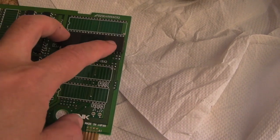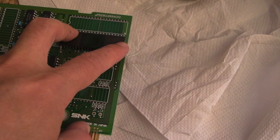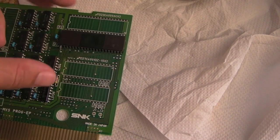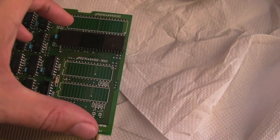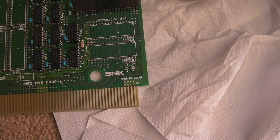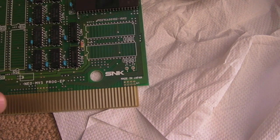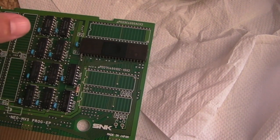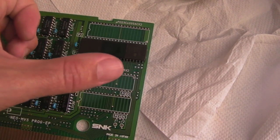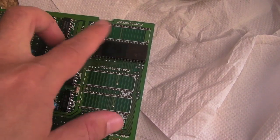It's a case of finding your two images for your game. In this case I think they're both 512 KB. Opening the hex editor, decide which one you want at the lower half of the ROM. In my case, I think I went for the original, revision 1, and then revision 2. You just copy the whole of the hex of the entire file, and go right to the bottom of the first file, the very last byte. You've gone past 7FFFF, and then just paste, and you should end up with a file that's exactly 1 megabyte. If you right-click and look at the properties of the files, the output file you've got that's 1 meg should be exactly the number of bytes of the two other files combined, and then you just burn that onto a 1 meg EEPROM instead of a 512k EEPROM.